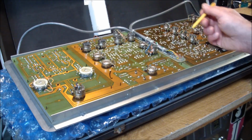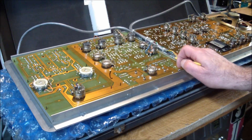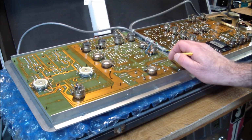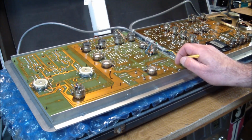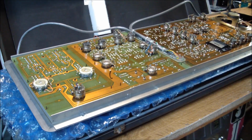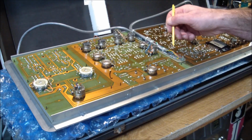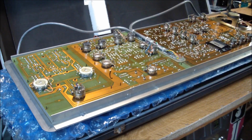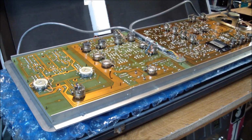So what I blame it on is the pins. I checked the solder connections and they look good. I did reflow them eventually, but there was nothing wrong with them. The pins also look good, but there was something on there, because after cleaning it with alcohol, the positive voltage came back to life and it was doing something. And that would actually make perfect sense.